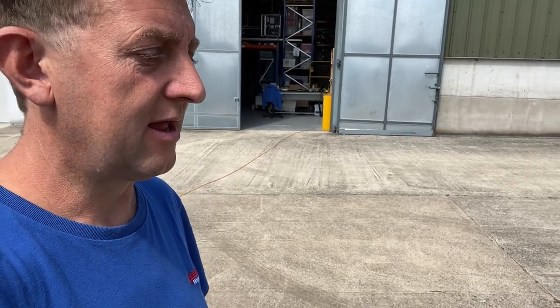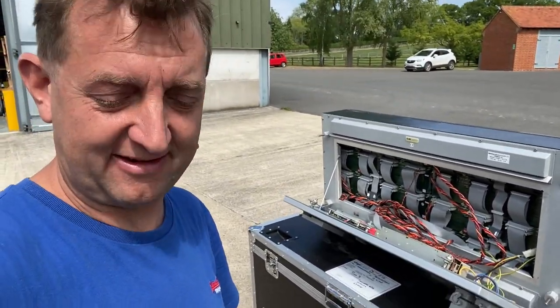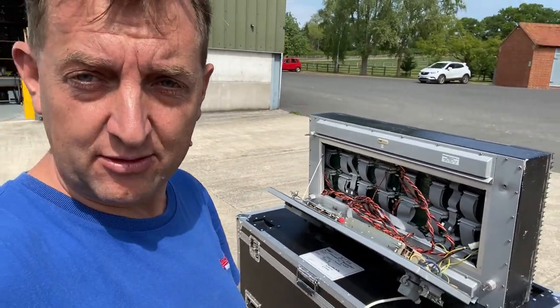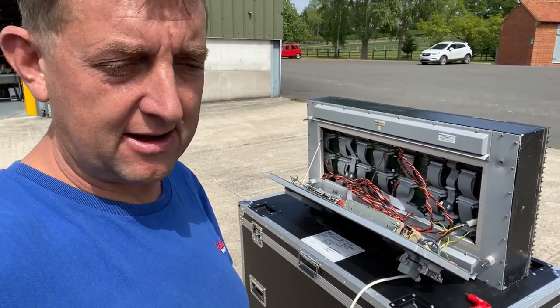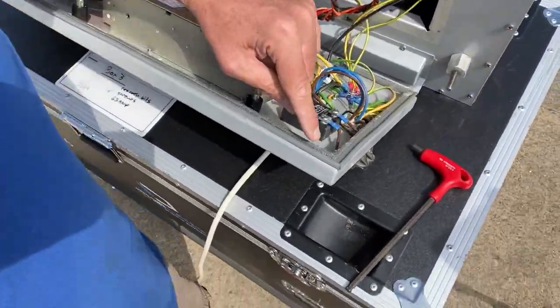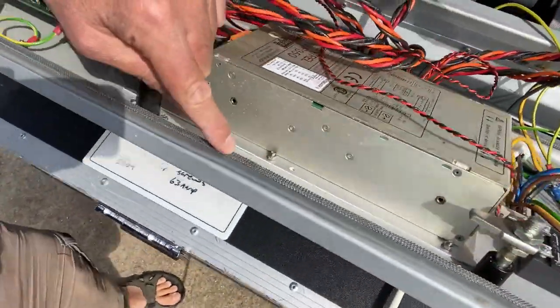There was, of course, a concern about this being true CE and having a genuinely good radio emission characteristic, because these were intended to be used on stages with radio mics. And remember, this is the 90s, so we were in an analog world. Radio mics were analog, signals were analog, audio cables running everywhere were analog. It was very important to have good RF behavior. And you'll see that one of the ways this was handled is with this RF braiding that's included here on the gasket all the way around.